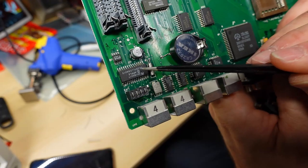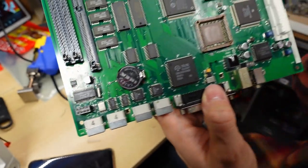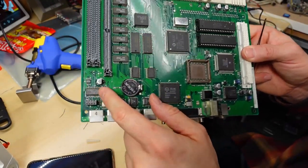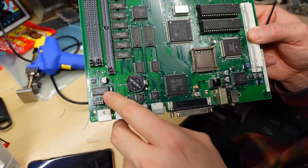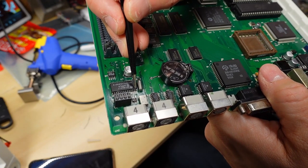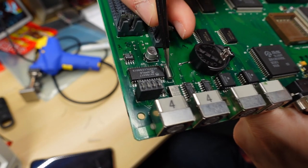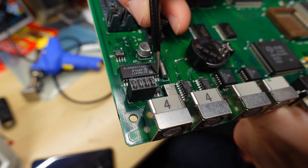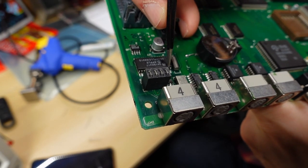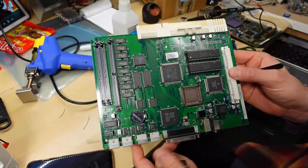And this chip, unfortunately, the battery here goes right into this chip. So this is probably responsible also for the power on of this machine. So if this chip is damaged because of the blue crusties that are on there, then unfortunately this board isn't gonna work. Now what's worrisome about the blue crusties being on these legs is sometimes they can make their way inside the package and destroy it. And the copper that's exposed, the plating that's on this one leg, it is right at the package. And there was a lot of blue crusty. I scraped it all off, but I'm a bit worried, unfortunately.